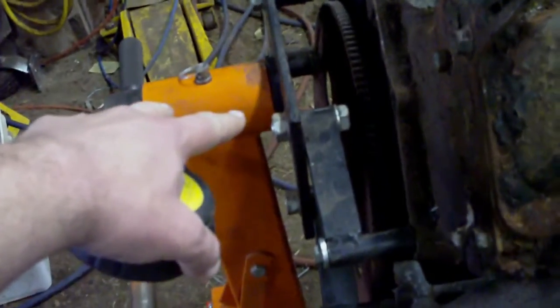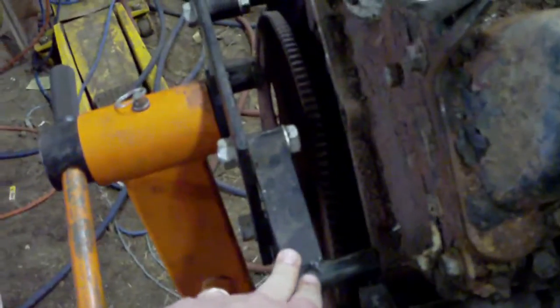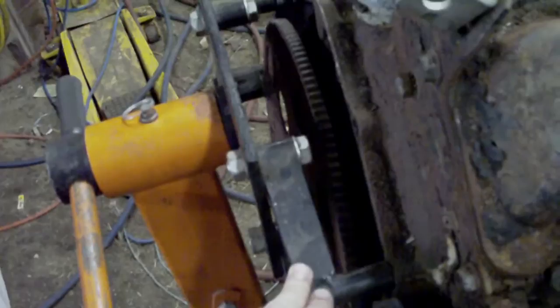If I were to make this again — I was watching Gears with Stacy David the other day and saw an interesting engine test stand he was using. It had adjustable mounts for the back of it, and those adjustable mounts looked like this. That test stand could also function as an engine stand because it could be rotated as well. If I were to build another or modify this one, I did like the adjustability — that would remove any of those critical dimensions. You could put them wherever you wanted. The only critical dimension would then become the longitudinal distances between your uprights.